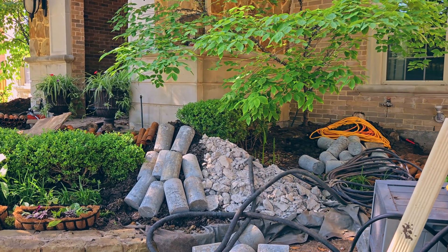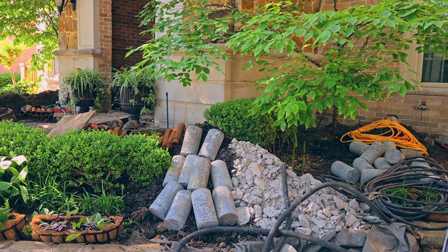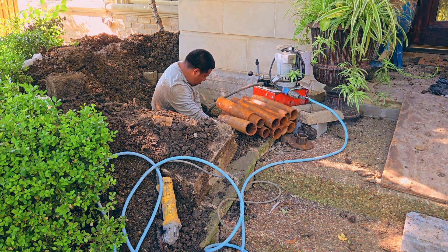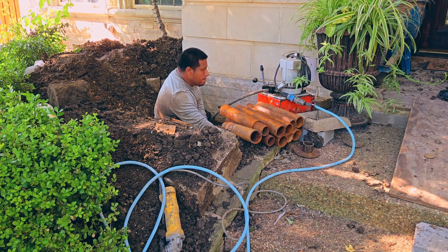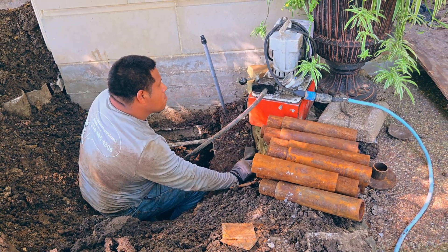The piers are going about 25 feet deep. We're installing 20 feet with a steel pipe and then transitioning to the last five feet with cylinders. We also need to do some interior piers, but to minimize the destruction inside the house we're going to be doing some tunneling.